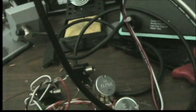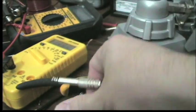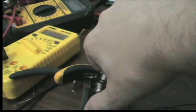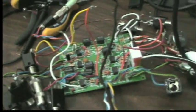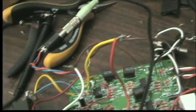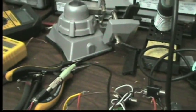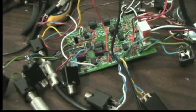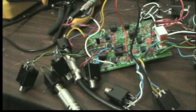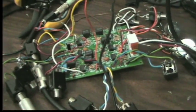We can attach this to the mixer output. We can use this in a couple different modes. This is a crossfade circuit that in its original mode — notice I've got a couple wires just tied together — gives you the option of crossfading between the original signal, which the easel calls having a low index, and the full ring mod signal, which the easel calls having a high index.